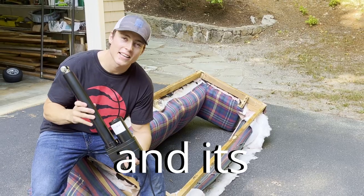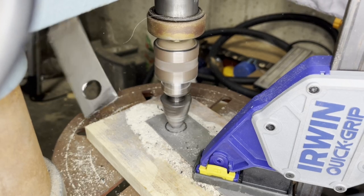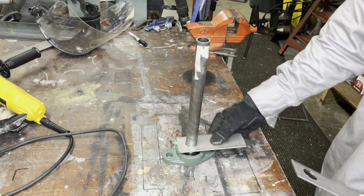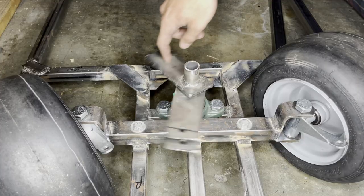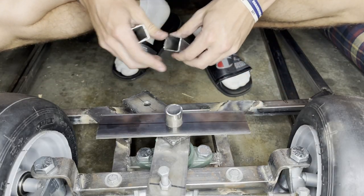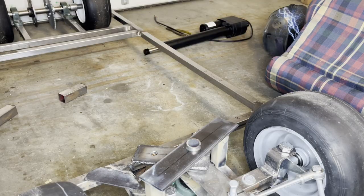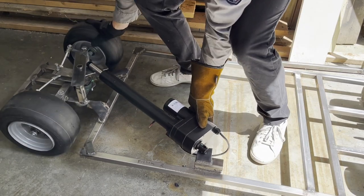This is a huge linear actuator and it's going to control the steering for the couch. A linear actuator is like a big arm — it pushes and pulls with great force. My solution is to weld two steel plates around a pipe, which transforms the linear actuator's linear movement into rotational movement. I then used some 3/8-inch threaded rod and bolts to connect the steering system to the wheels. Since the actuator can push and pull with 800 pounds of force, I added extra support so it wouldn't rip the cart apart. Now the wheels will be able to turn left and right from the pushing and pulling of the linear actuator.